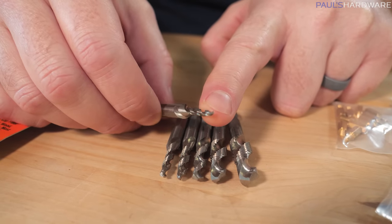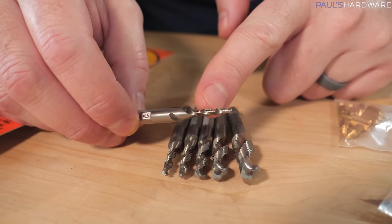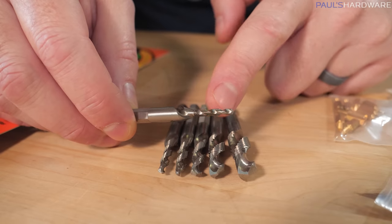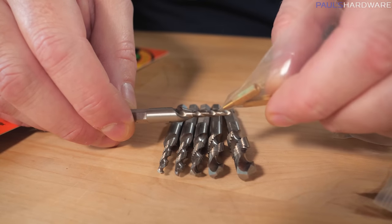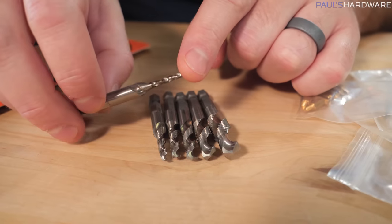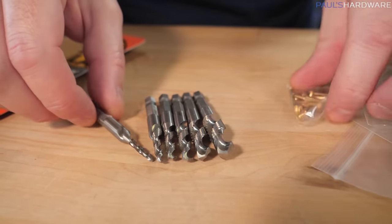One method I'm going to attempt is to not use any adhesive or glue or anything like that. So these are called tap bits — it's a drill bit on one side, but then it goes into threading. So I might be able to use this to drill an M3 threaded hole into the wood, and then just take the standoff and thread it into that hole, which would probably be the simplest solution.